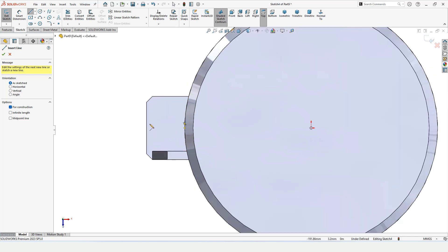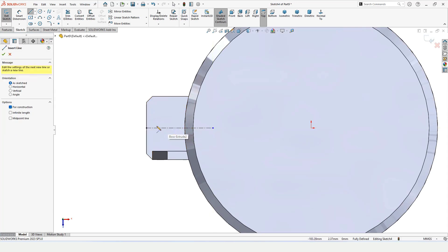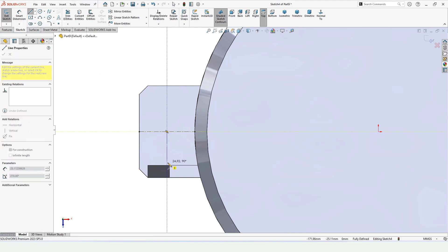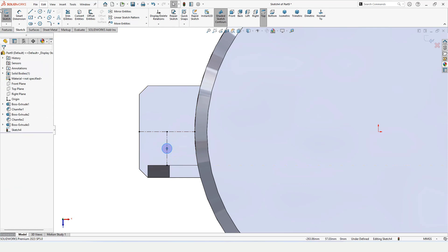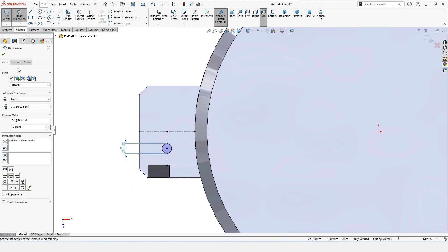Select this face and click on Sketch. From this point to this point make a center line, then drag it up to this reference point. Make another center line from this point to this point. Select the circle — we have the reference. I use center lines to create references; they are very useful. Specify the diameter of the circle.